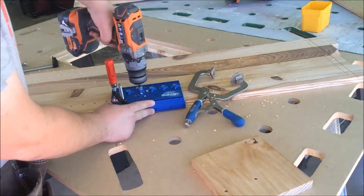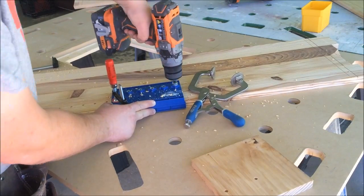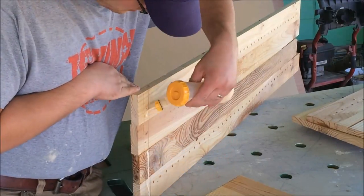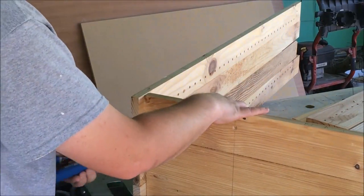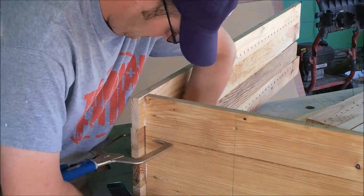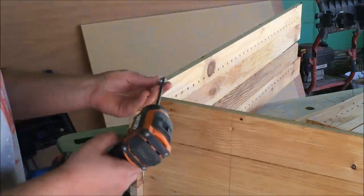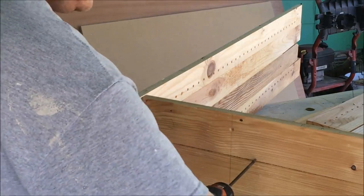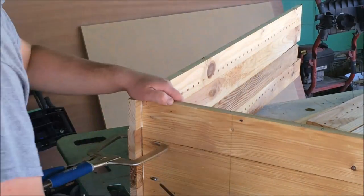Having the adjustable shelves is really a big perk. You can see I'm using a multi-function slab that I made in another video to use as a kind of holddown since it's a little grate table. Once I drilled all the shelf pins, I just reassembled it with glue and pocket screws for final assembly. Doing a dry assembly really helps because you get to make sure everything is right — you get a little more adjustment and then you can take it apart.